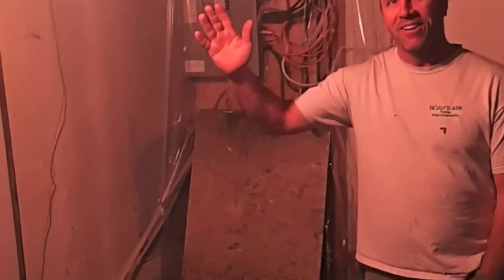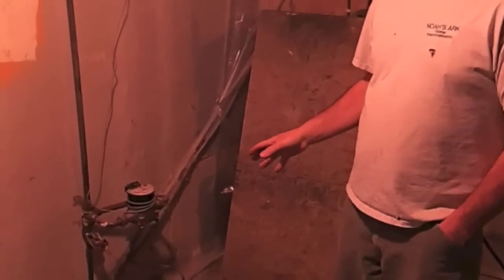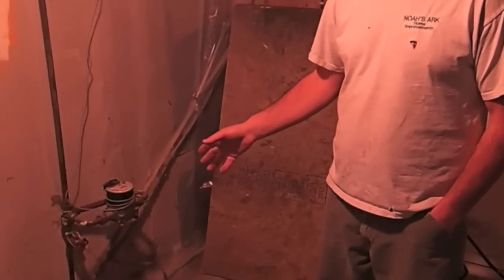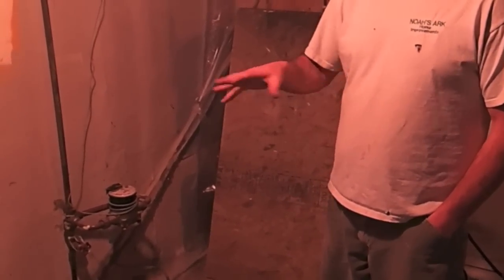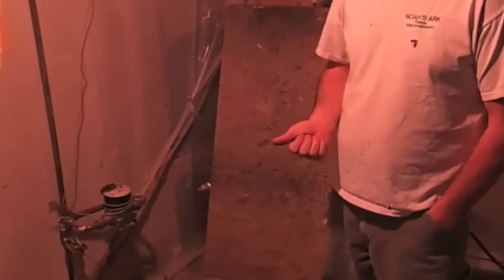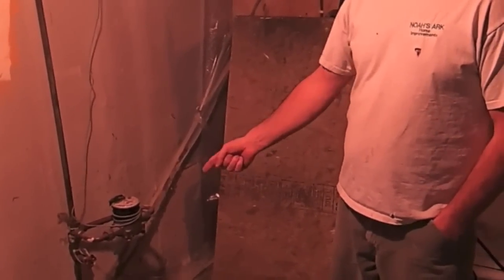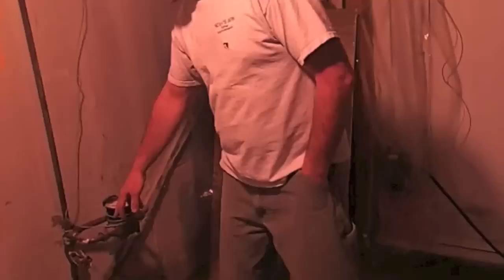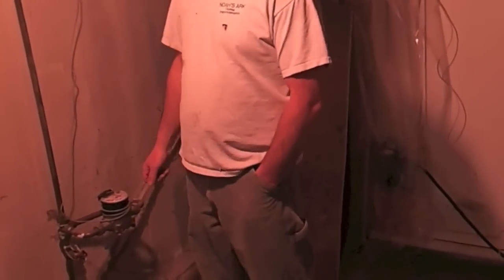So what we're doing today here on Skip and Derek's home plumbing services — we can't get the main shut off outside, so we have a major decrease in pressure for this house. We're doing a one bedroom basement apartment down here and a four bedroom upstairs, so we need to maintain pressure. We've got three-quarter malleable copper coming in at the floor, drops down to half inch, increases back up to three-quarter for the meter but then immediately drops down to half inch again.